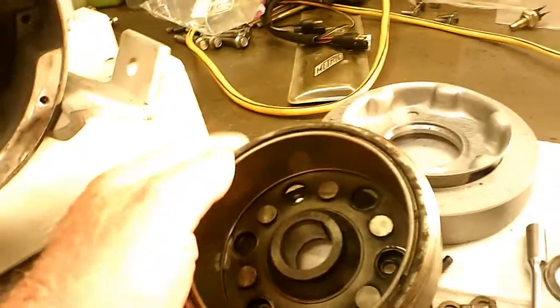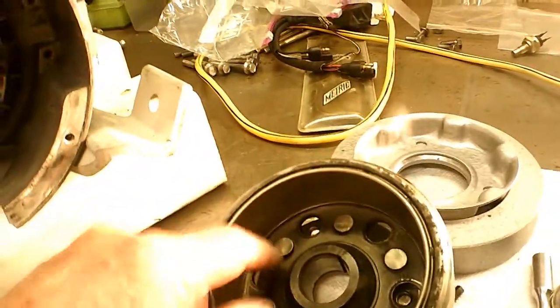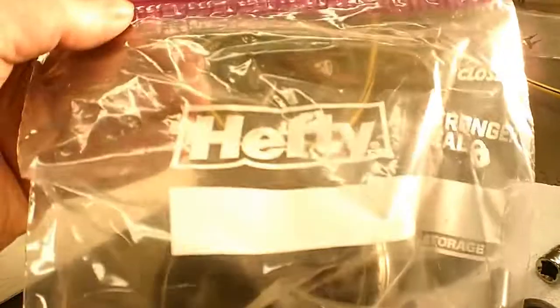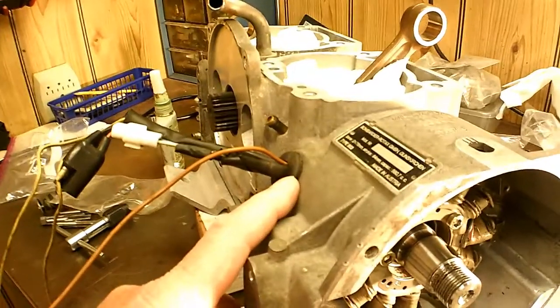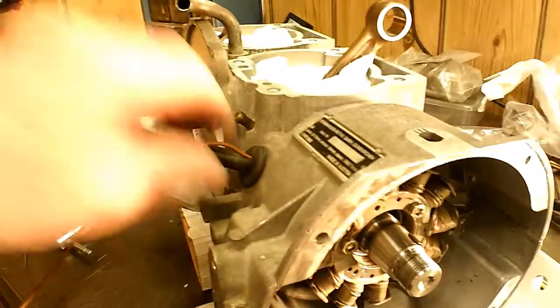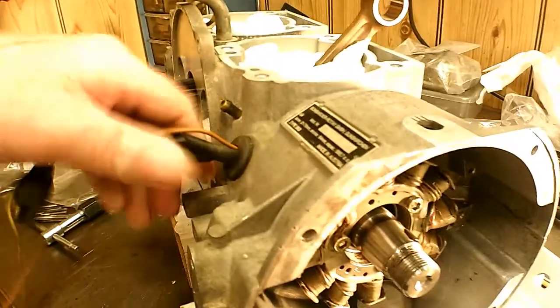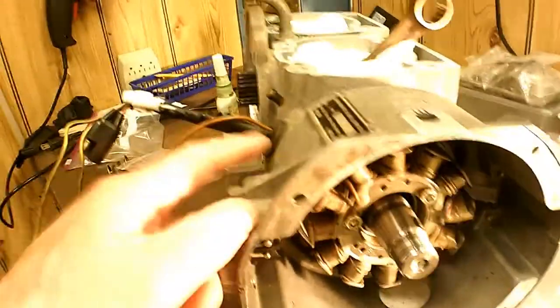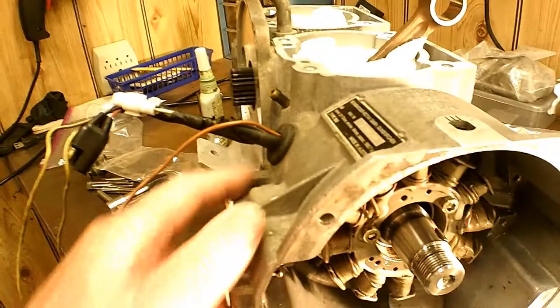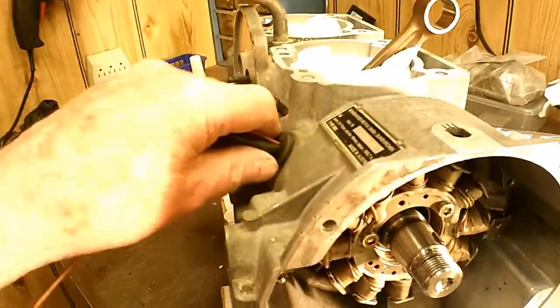You do got to watch chips and the magnets and everything. So I keep these in a plastic bag until I'm ready to use them — just a hefty bag like that so the chips don't get in there. Getting the grommet in there, I spray it with some silicone spray and it'll slide pretty good on the wires, and push it into the case — just did it with my fingers. It's pretty easy to put the grommet in, but you got to take the grommet out first, and you put it in last after you get the wires through the hole.